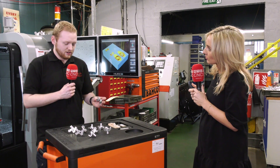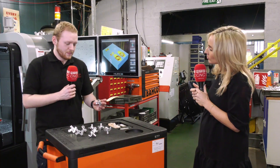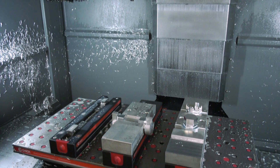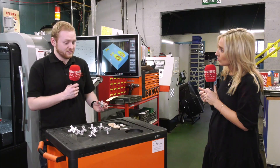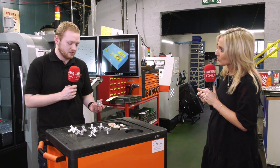How we're doing it now is we're using a three-axis machine. We can hold the part in three different operations — upright, sideways, and sideways — which allows us not to have to spend the outgoings on a fourth axis. It also allows us to use the same vice set to run a variety of different parts without having to think about the machine.